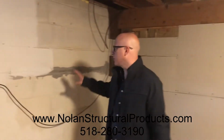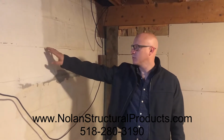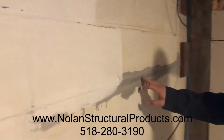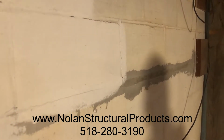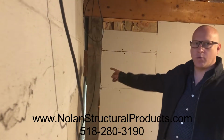Today we're going to demonstrate how to install the wall straps against the foundation wall. Here's a typical 8-inch thick concrete block wall that's pushed in. There's some cracking in the wall, and there's also some patching that was done. And you can see by looking at the straight post there how much that wall is pushed in.